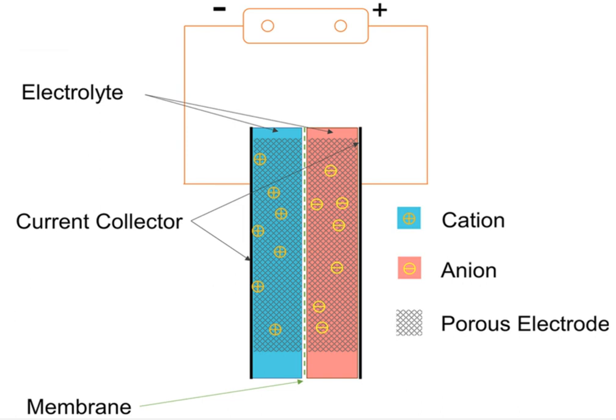Street lights. Sado City, in Japan's Niigata Prefecture, has street lights that combine a standalone power source with solar cells and LEDs. Supercapacitors store the solar energy and supply 2 LED lamps, providing 15 W power consumption overnight. The supercapacitors can last more than 10 years and offer stable performance under various weather conditions, including temperatures from +40 to below -20 degrees Celsius.